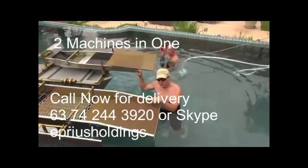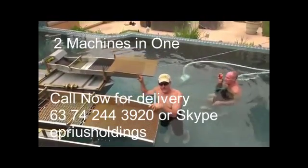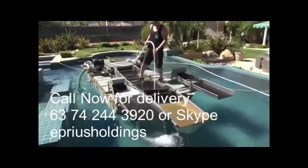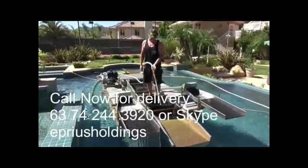Most of the time when you're running, let's say, a 6-inch dredge, you're going to be transporting home 4 or 5 gallon buckets of concentrates at the end of the day. Well, that's a lot of material to sort through. That can take hours and hours to process. But you've already got the ultimate concentration system right here, so the best way to handle it is to let the dredge do the work.